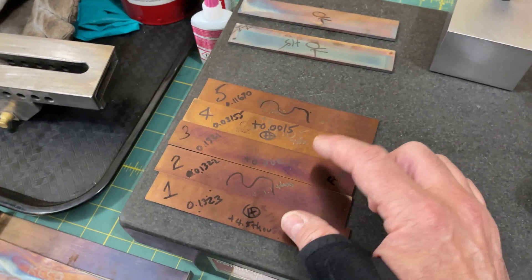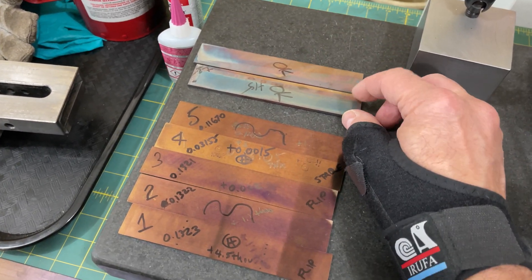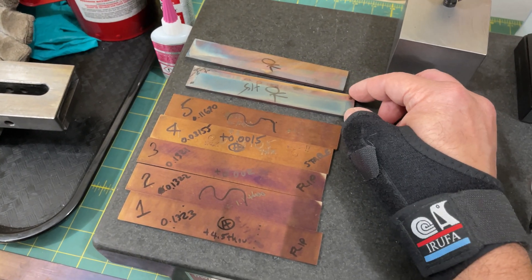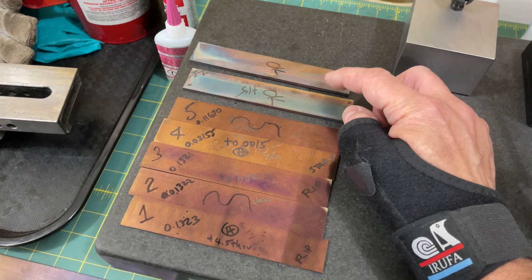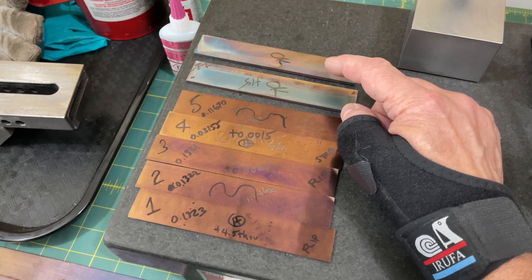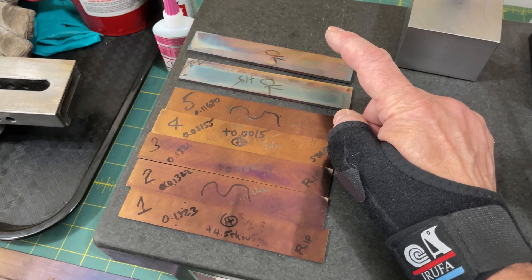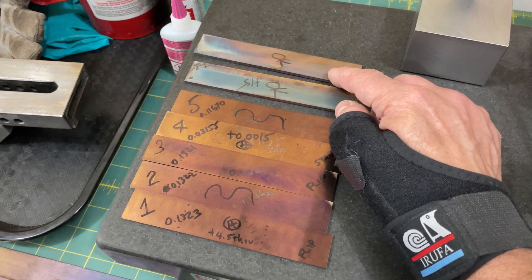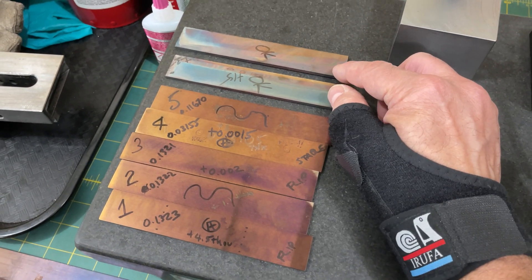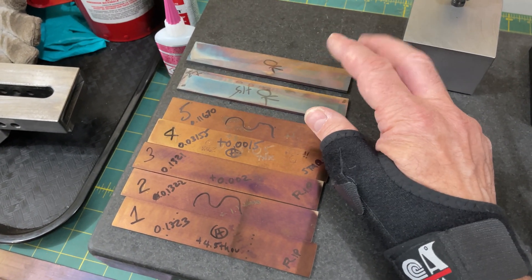I had an epiphany: batch number one yielded two parts which were not great, but I think I may grind on these just to see how stable they are. I believe that mechanical straightening early in the process is wrong, and I built stresses into the parts on batch number two. But batch number one never got mechanical straightening, so there's a possibility that these are actually more stable — so I'm considering doing that.